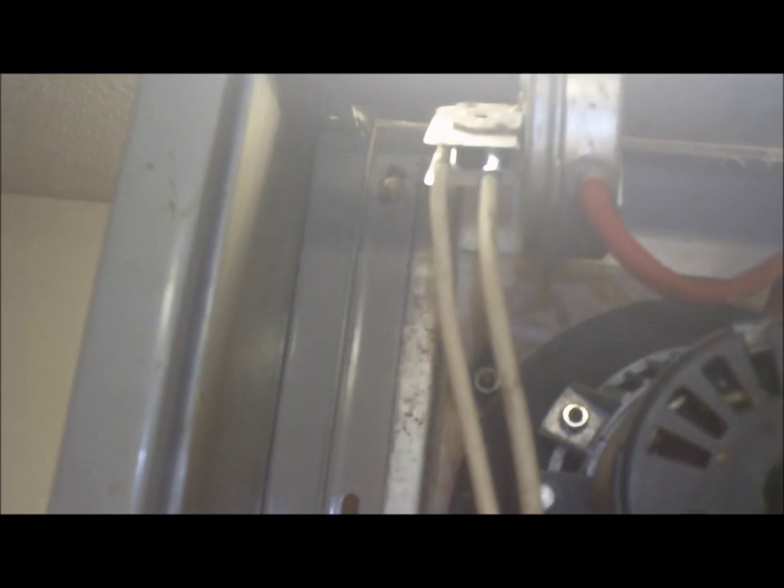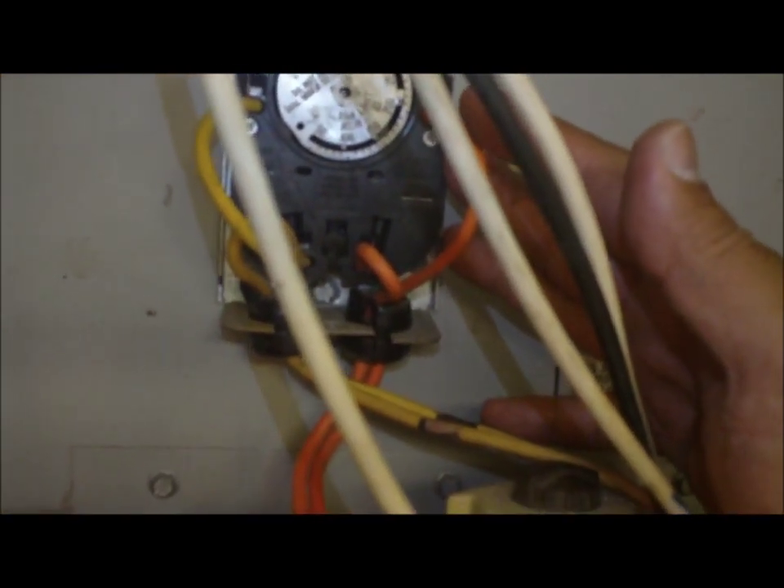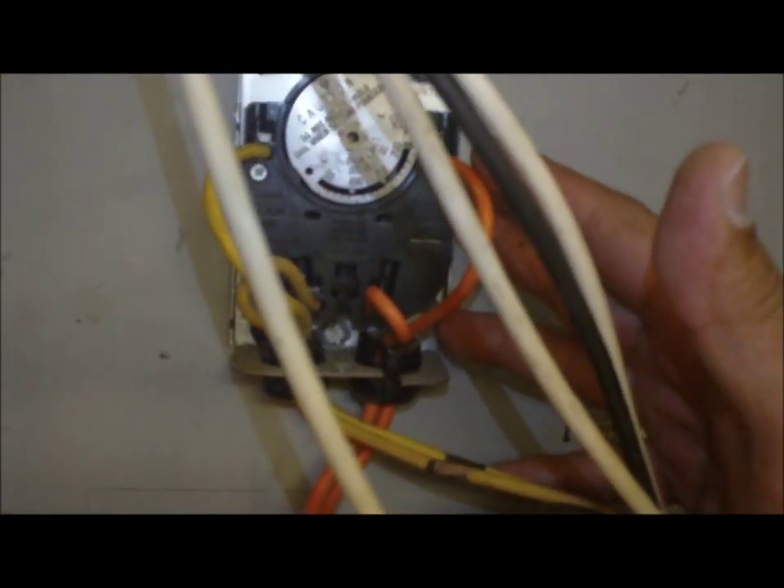When you call for fan, the dial will turn — at about 100 degrees it will turn the blower motor on and start blowing hot air into the house, heating up the house. When it reaches a certain degree — say 150 — you will hear another click, and it will shut off the inducer draft motor. No voltage will come to your pressure switch, no more voltage to your ignition control unit, and it will cool off the heat exchanger until it cools off, then turn back on again. This is the combination fan limit switch — it's a safety switch to prevent the system from overheating.